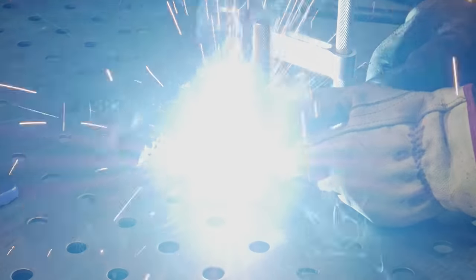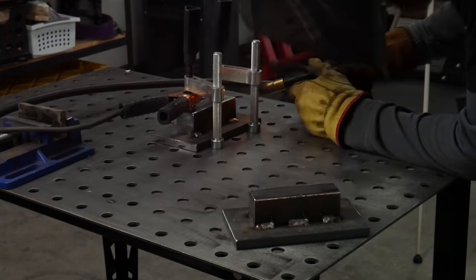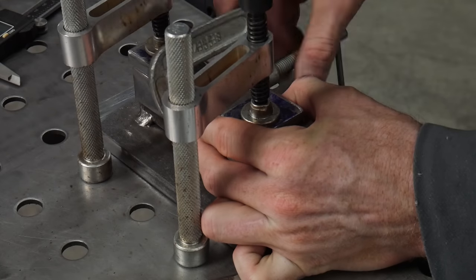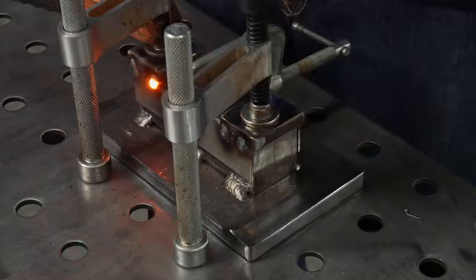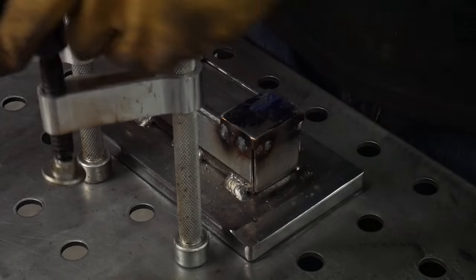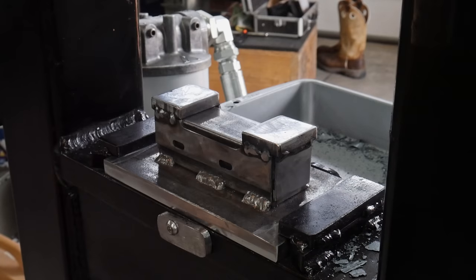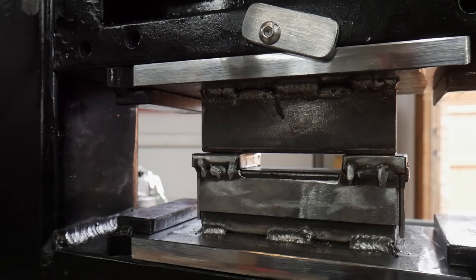While drawing out the first stack I had a hard time controlling the hydraulic press and not over-smashing or over-thinning the stack. To mitigate this I'll be making some kiss blocks on a new set of dies. The way these work is I weld the kiss blocks to a saddle, and I can make a couple different sizes with different saddles — so all I have to do is take them on and off the square dies. These stop blocks prevent over-thinning and allow a consistent thickness on my final billet, which aids the cutting and stacking process.